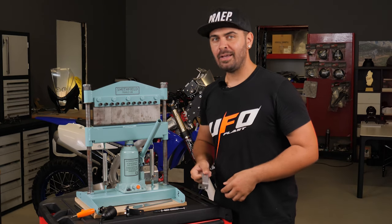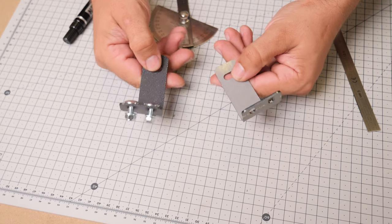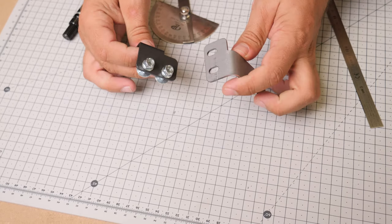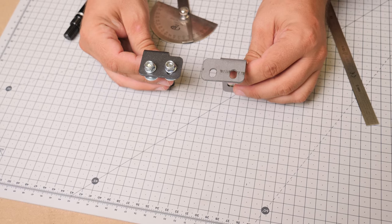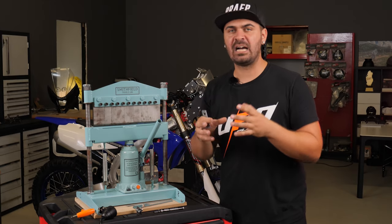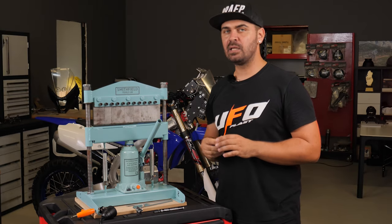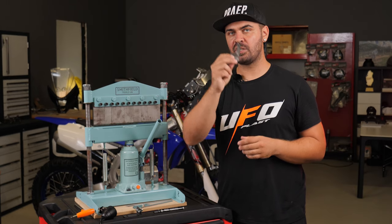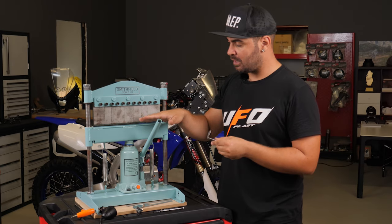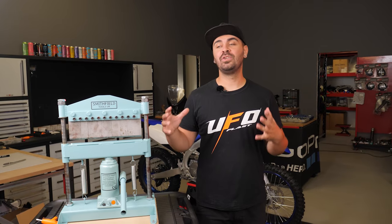Done — let's check again. I managed to achieve exactly 90 degrees. This shows you how an inexpensive tool can change your garage life. We now have an exact copy of this bracket. It was just for demonstration, but just imagine how many times you want to place a fairing or mount a device like a GPS and make a custom bracket because you can't find any on the market. With this bending machine you'll just need to have someone laser cut the blank, or cut it by hand with an angle grinder, and then design whichever brackets you want for your bikes.